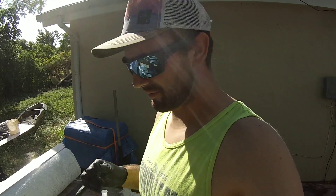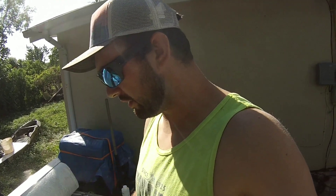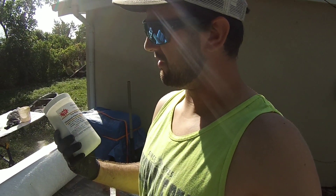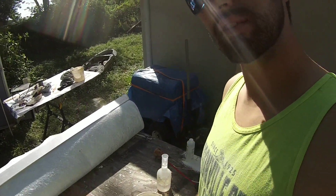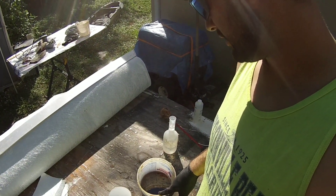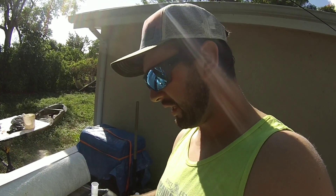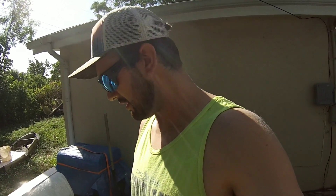This is how I make my peanut butter, a.k.a. thickened polyester resin. How I do it: I use my fumed silica, my quarter-inch chop fibers, and obviously polyester resin, and then this is my M.E.K.P. hardener catalyst. I'm going to get this mixed up, thickened up, and then we're going to start laying the foundation bonding so I can bond my bulkhead down in.